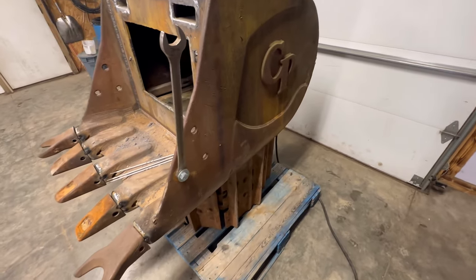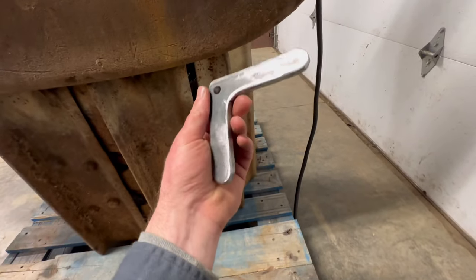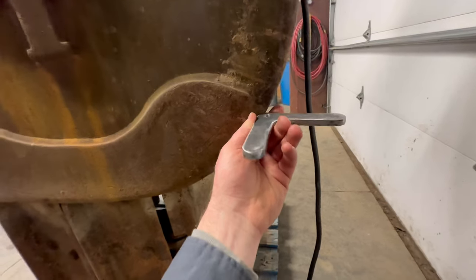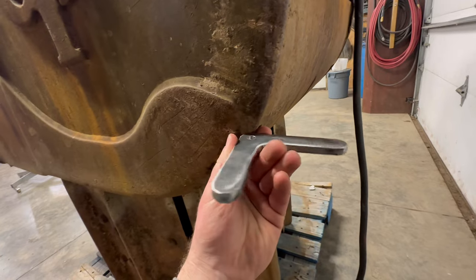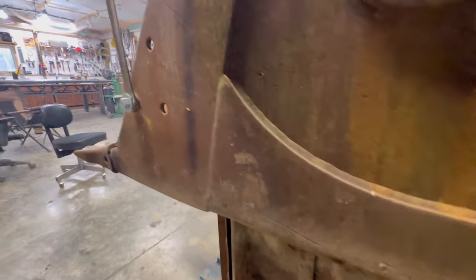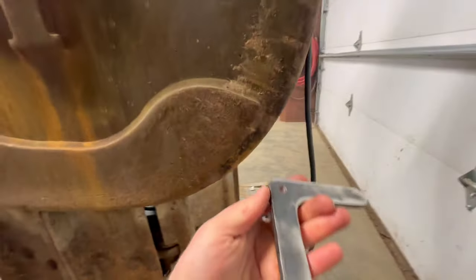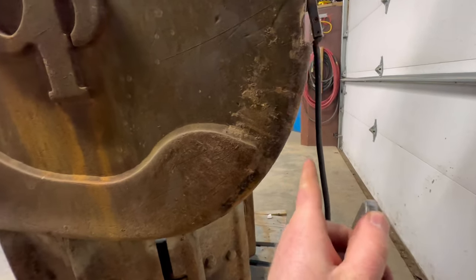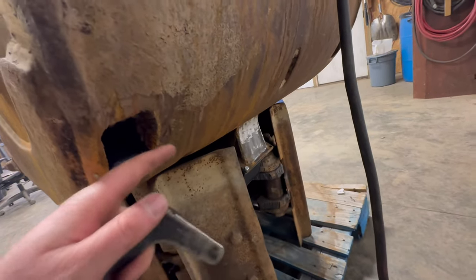So I'm going to start working on the damper system. It's going to take some prototyping, but I cut this boomerang out. And I'm going to make some little tabs and weld it somewhere around here so that this is going to pivot. And then on this end, I'm going to have some heim joints connecting to this wrench lever. So when that wrench lever turns, this is going to turn. And then I got to transfer that rod over here somehow and make some doors.